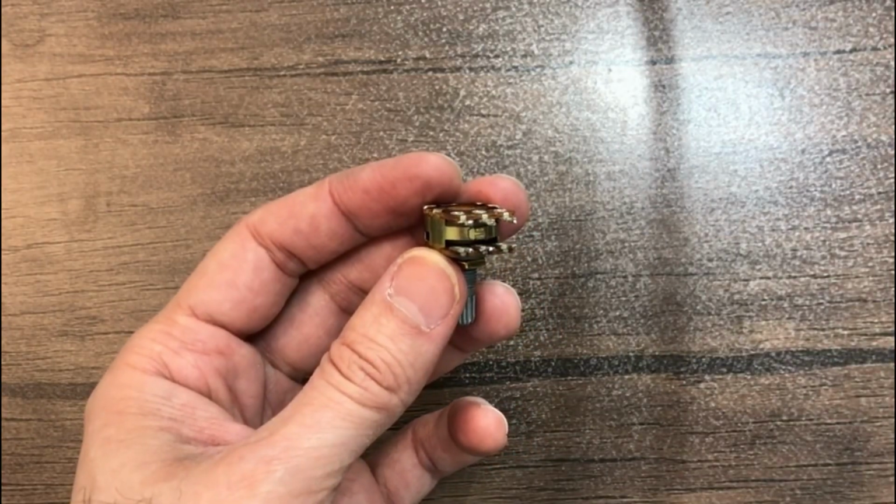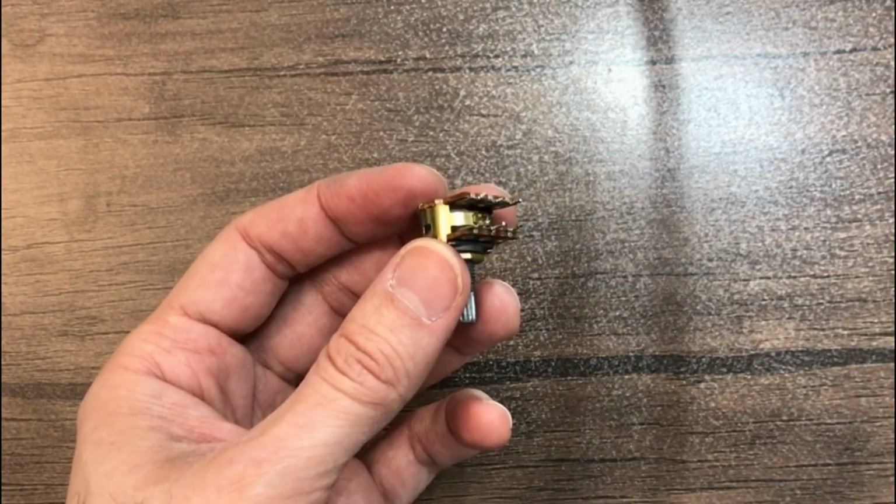There are a lot of sources saying that the problem is coming from accumulation of dust and dirt. I don't believe so. Despite the fact that many of these potentiometers have a kind of window toward the outside, the reality is that inside your electric guitar, they are completely isolated in a box, so nothing can enter them significantly.